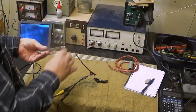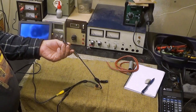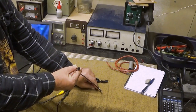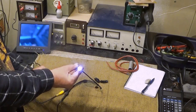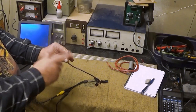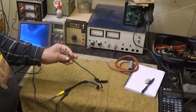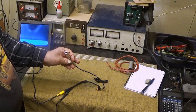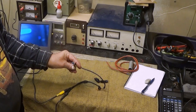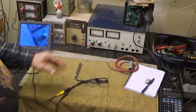And then the thing with this one is also that it has a very delicate lens on the tip, and it also has these lights. When I light it up, now you probably can see there is a light. I don't know whether this is usable. Anyway, in metal working, in a lathe or in a milling machine, this must be protected somehow. And it's not enough to keep a distance to the workpiece, because the lens here is very small, about 1 millimeter in diameter. And if a small drop of oil goes there, it's basically ruined.